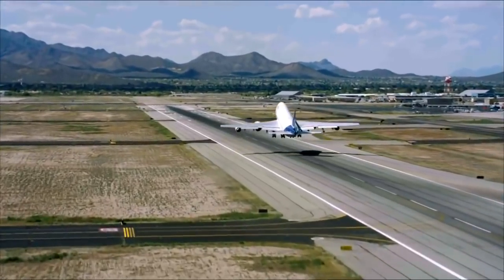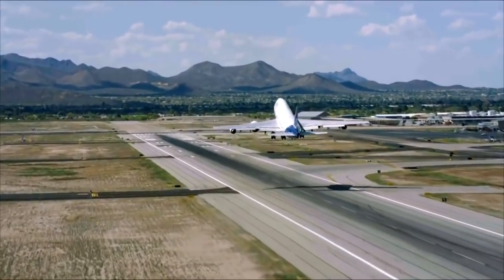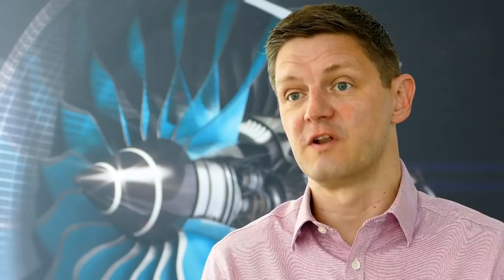The Ultra Fan programme is developing all the time. We're putting more and more vehicles to test with elements of the Ultra Fan programme, with continuation of the gearbox testing. Over the next few years we'll move towards engine testing where we bring all these technologies — the gearbox, the turbine, the combustor, the composite fan — together in the Ultra Fan demo. First of all ground testing, then we intend to go and fly the Ultra Fan on our 747 flying test bed.